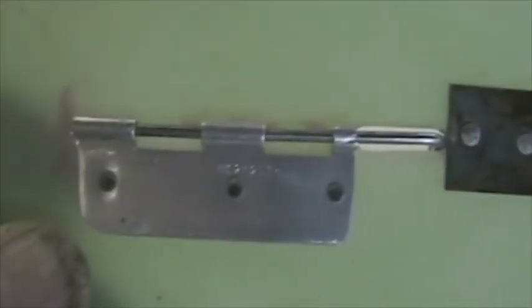I've riveted on a spring clip at the rear, and I've taken a few segments of piano hinge at the forward edge, used a piece of piano hinge wire, bent a 90 degree angle on it, and made a little slot. The spring clip I've taken off a normal fabric inspection cover that you'd find on a fabric aircraft.